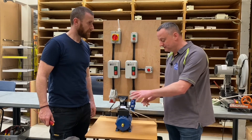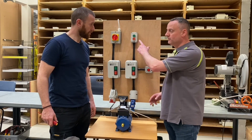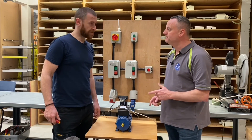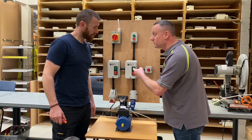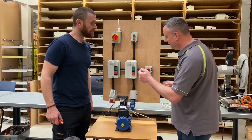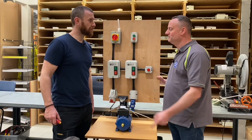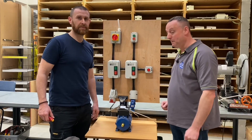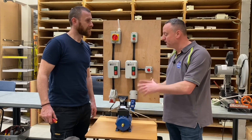In this video presentation, we've got a single phase motor with a direct online start and remote stop start. We're going to physically show you those connections that were drawn before. So with that in mind, if I press the green button, that should start — and if I press the red one, it should stop. So single phase motor direct online.